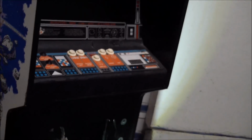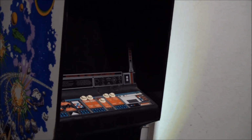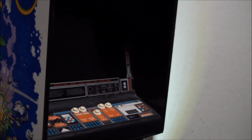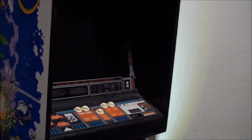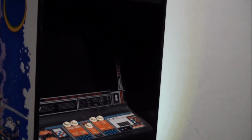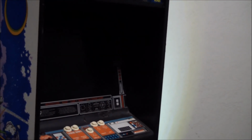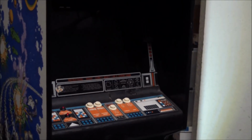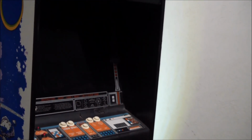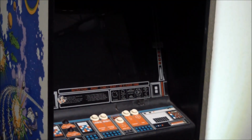One other major giveaway, though, is that these monitors, the spot killer wasn't lit. What does that mean, you ask? Well, a vector monitor, if it doesn't get a signal, the beam would be hitting the dead center of the tube all the time. And if you let that go on for a long time, first it'll burn through the phosphor, and eventually it'll actually burn through the glass. It'll puncture the glass, and you will be having lots of electrons spilling out, and depending on their configurations, fry you really good. So what they did on these monitors is their protection circuitry that detects if there's no valid signals coming in on the X or Y, and if that happens, it turns on the spot killer circuit, which turns off what shows up on the screen and lights an LED on the deflection board.